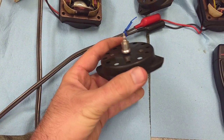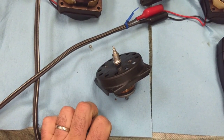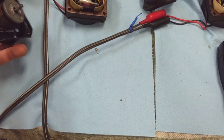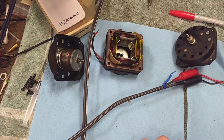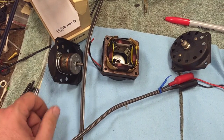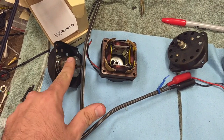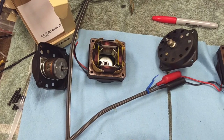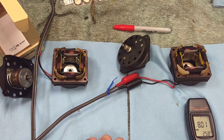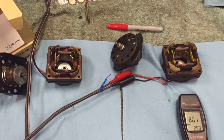You can make them spin at the right speed by increasing the electromagnetic field from the field coil, but that shortens its life significantly. Until there's a way to re-energize these, it's going to mean looking for a parts unit to salvage a motor from. Or maybe in the future we can mount something better, or get a motor from a dual 12 series like a 1209, 1229, etc. — those motors don't seem to suffer this failure. I've literally bought brand new old-stock motors that have been sitting in a box for decades and they too have the symptom of not holding speed, wavering, wow and flutter — signs of motor death.